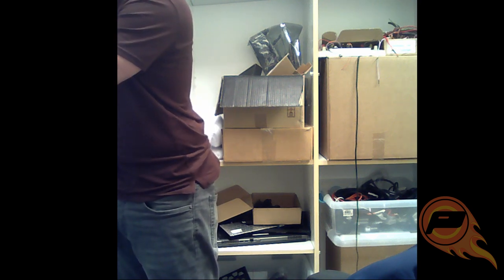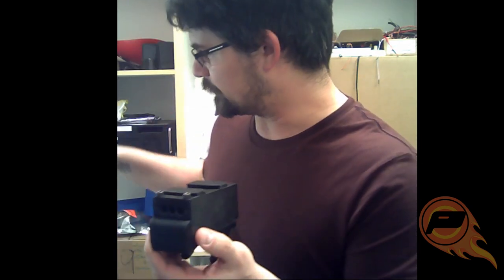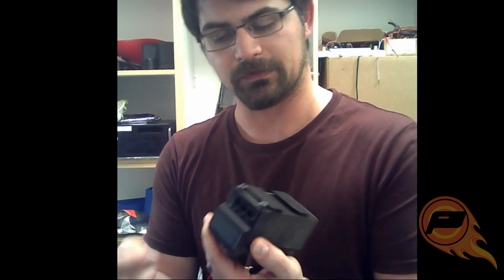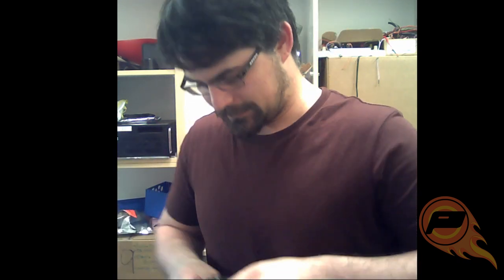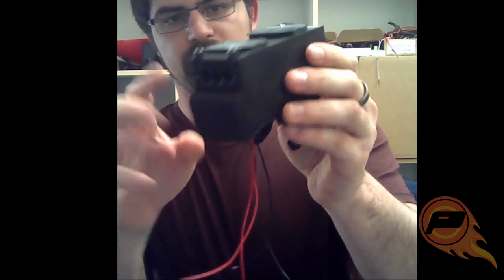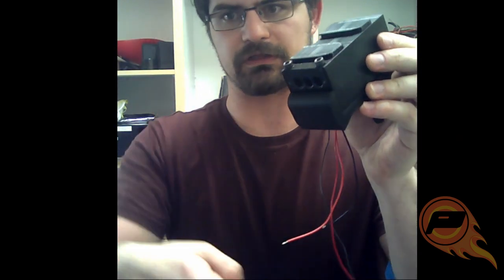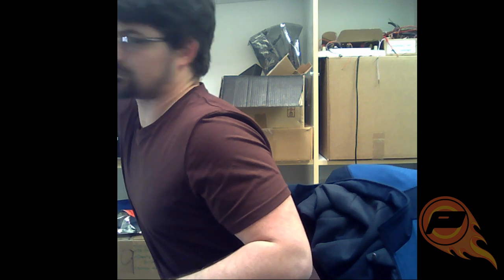One of the coolest things that he's done, I'll show you, is this thing, which is a thermoelectric pump cooling system that's going to be attached to his effector through some hoses. So we got three hoses out, and there's three hose inputs on his effector that go to a little cooling ring on the bottom that gives it a nice even output. And so hot air comes out the bottom part. Start trying to get that off of there. Well, that's not happening. I kind of put them together pretty firmly. But either way, the hot output on the bottom here is getting redirected backwards out of the 3D printer. Cold air comes out of the top of this and will get rerouted down to the effector, the cooling parts. And we're just going to use some silicone hoses for that.